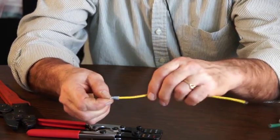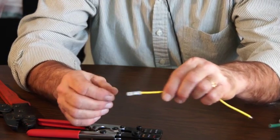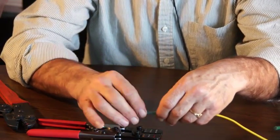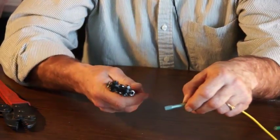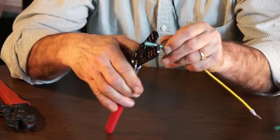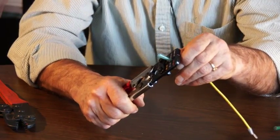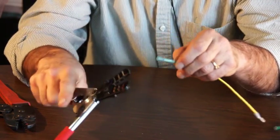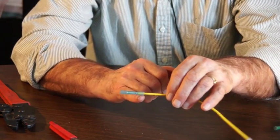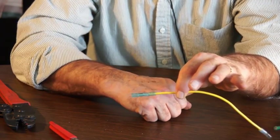Every termination has a poundage — it has to resist so that you can't pull apart conductors and terminations. This is a heat shrink butt connector, and for this I'm going to use a single crimp tool — only one set of jaws. We pick the blue. We're in the middle of the barrel. We crimp down until we hear the ratchet release. And now we have a solid crimp that I'm able to heat shrink the back end, instead of having insulation be gripped by the barrel.